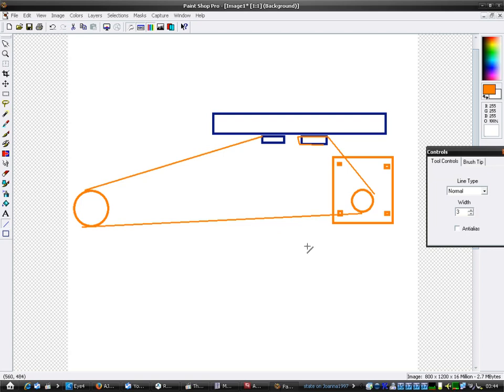Now, what do you think that does? I'll tell you what happens. Because the belt is almost vertical over here, the table actually moves more, so the table actually moves faster in that direction at this point than it would when the table was over here, because of the angle. So basically the alignment of the belt is really bad, right?